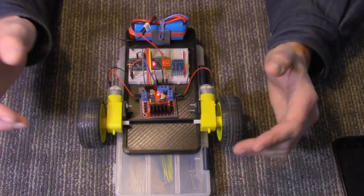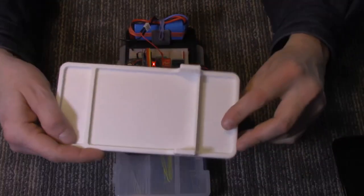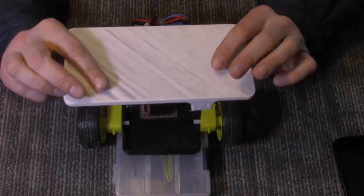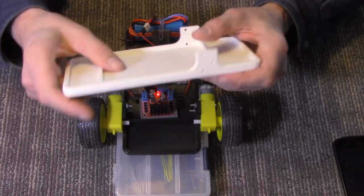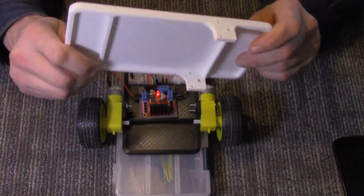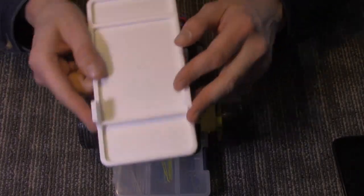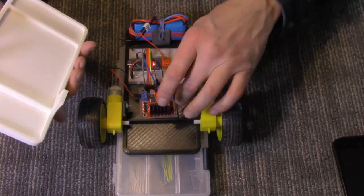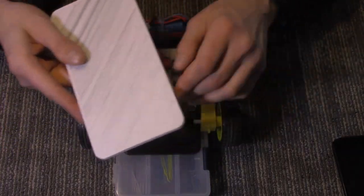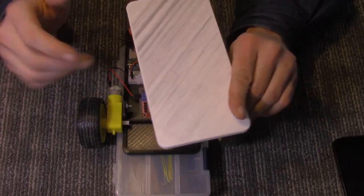What we have operating this is, of course, the 3D printed robot base. I've got another one here that I printed out before the final just to check it — it has almost no infill, so it would snap. The final ones are not as flimsy. They've got holes and notches so the motors bolt right in. If you don't like the little pockets, you can flip it upside down for more clearance underneath.